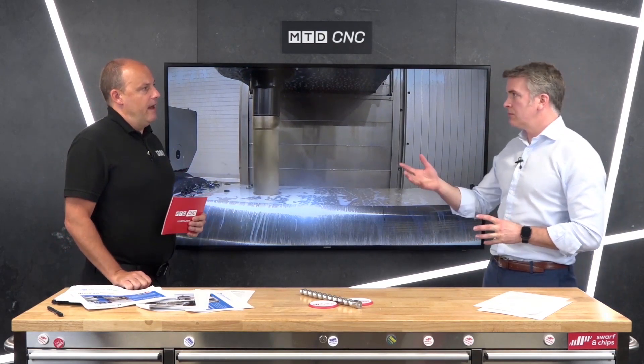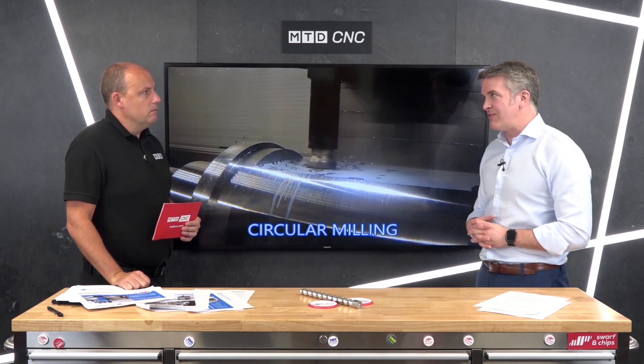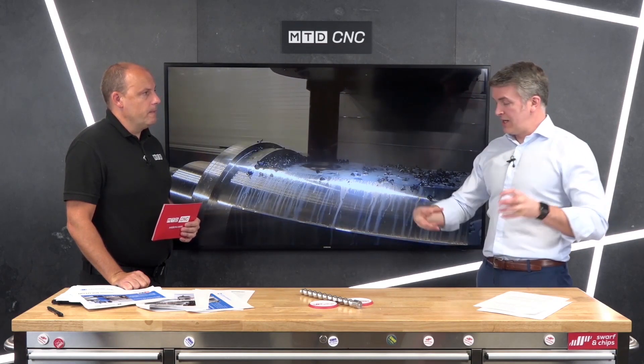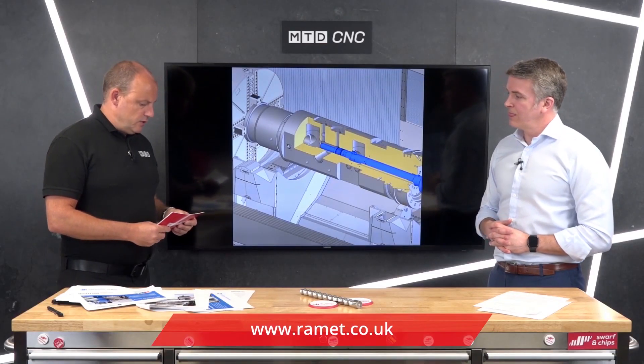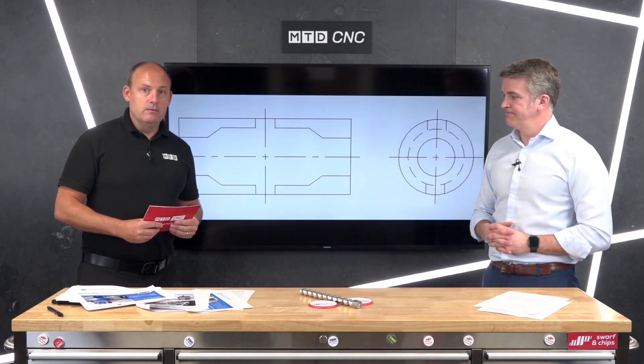What other industries would this fit perfectly? With the two spindles, anything that has two operations — which most parts do — lends itself to this machine. The compressor industry is a great example: the tolerances within compressor rotors are very tight. If you can transfer the part safely and rigidly to the second spindle, hitting tolerances on the second side becomes much easier every single time. We're already working in that area, and with head changers for the different tool types required for specific applications, there are very flexible solutions available from RAM Engineering and Tooling with the Weingartner.